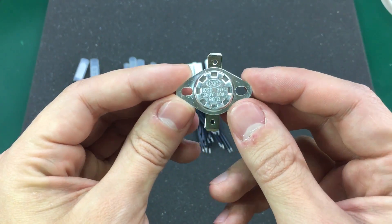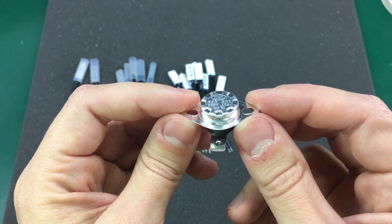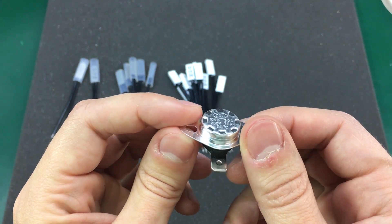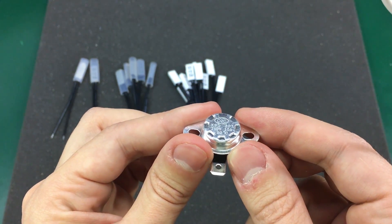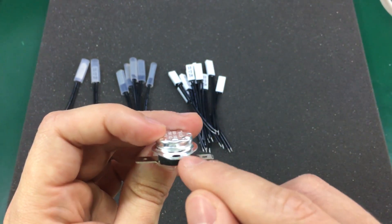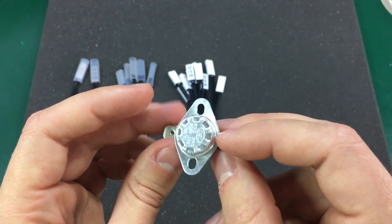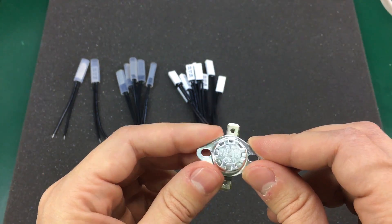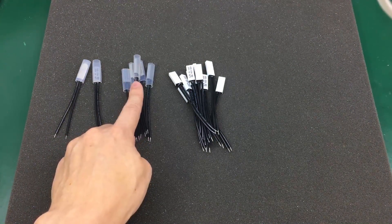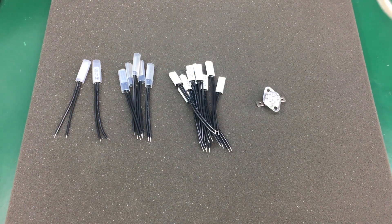Another model I have here is slightly bigger — it's called KSD301. This one is rated for 10A 250V, so it's the kind of switch you would use for something of higher power, like for a small 2000W electric oven to protect it from overheating. Although it has a metal outer jacket, the switch terminals are isolated from the actual metal jacket, so it's safe to connect the outer package to anything. This one is also normally closed, and as I mentioned, these are fine for protecting something by disconnecting. But I need normally open ones for turning on a fan when the target temperature is reached, so I will use the normally open ones for my power supply and dummy load project. The link in the description will show both normally open and normally closed in a search result, so you just have to pick the one you need.